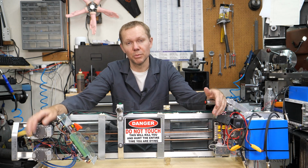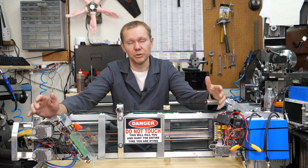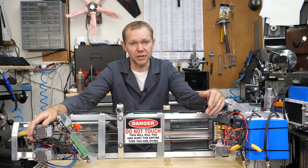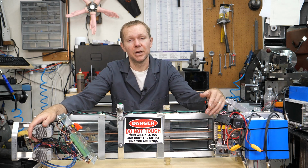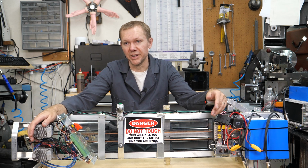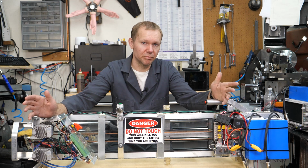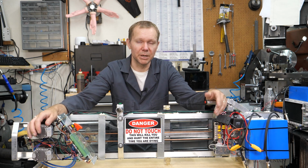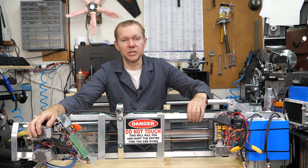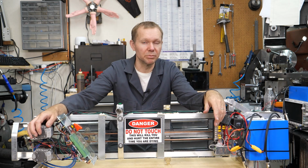They're servo motors, but I bought a model that is configured to work like a stepper motor. You can go into the configuration software from ClearPath and just pick the steps per revolution that you want. They defaulted to 800, but I set them to 200 because that's a very common stepper motor steps per revolution. I had done the math and figured out that each step was less than a millimeter of belt travel. I was like, okay, that's probably going to be fine.